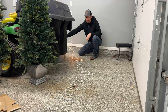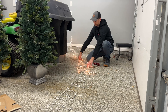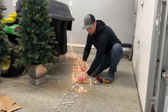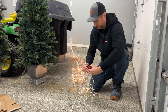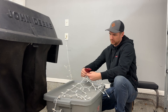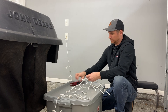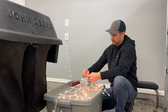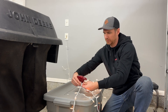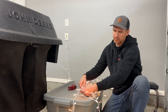At first I thought there was no way this tool was actually going to work, but I was quickly amazed at how fast it fixed my light sets. So what exactly is happening here? When a bulb burns out, there's what's called a shunt that is supposed to allow current to continue to flow and keep the whole set lit up — just like that guarantee on the box says. In reality, Christmas lights are trash and it's very common for that shunt to not work the way it's supposed to, and in that scenario you lose the whole section. The Lightkeeper Pro sends a pulse through the light set to kick-start or re-energize that shunt and keep the energy flowing throughout the string so the whole thing comes back on.